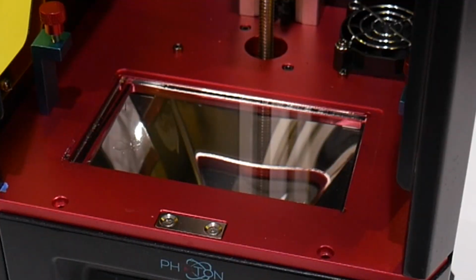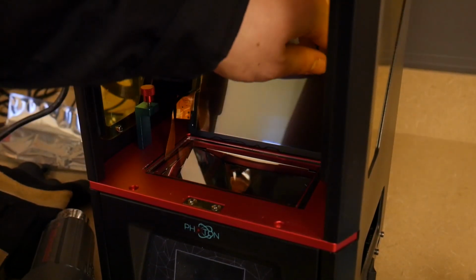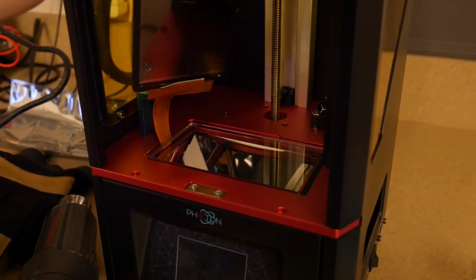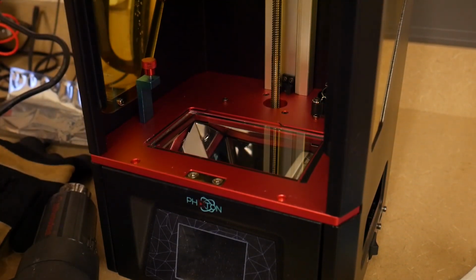So you might be asking, what printers work best for this screen? The short answer is any resin printer that had a 5.5-inch RGB color screen inserted into it. They are the identical size dimensions, and depending on which variant you get, the protective glass thickness is even the same, which is good because it effectively makes this upgrade a painless, easy drop-in replacement.